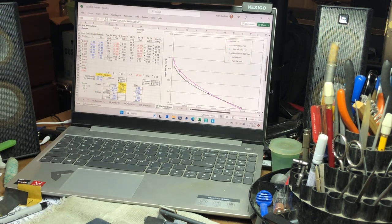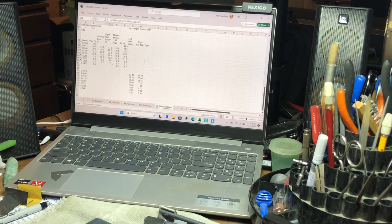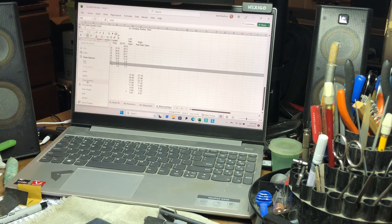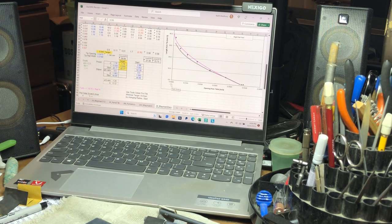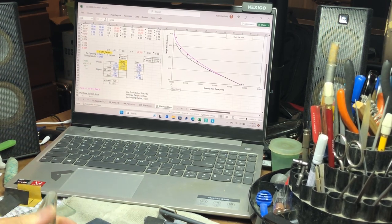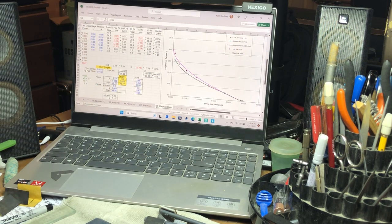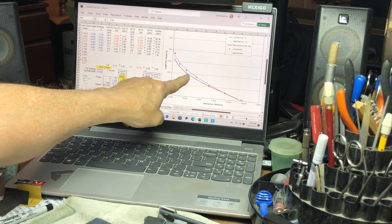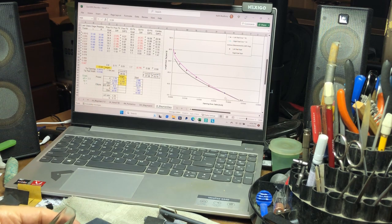So what I'm going to do is worry about that later, and I'll keep taking measurements. I'm going to get rid of it temporarily from the graph, because I think that might be more accurate, and I'll just do it more by feel in this area. If it is accurate, having that gauge in there, I'll have to close the tip a little bit more, but I'll worry about that later. So, you can see that we have extra material to take off through all this area, but near the tip, we're a lot closer to the target.